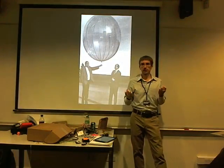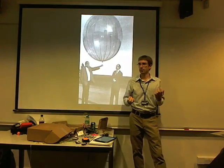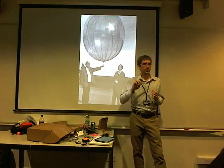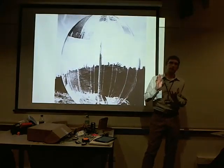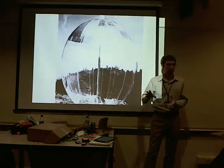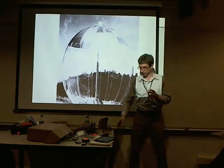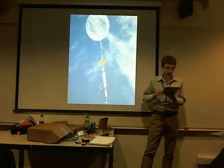The very crude method of simply measuring lift was found to be completely inadequate — they could not control temperature and humidity finely enough to measure that low a loss. They tried spectrometers around the balloon to find leaks, but equipment at the time was no smaller than suitcases and unwieldy in the field. So they actually put balloons in pools of water and looked for microbubbles. The GHOST program citation has a whole chapter on the different leak test techniques they developed.